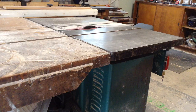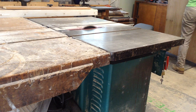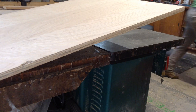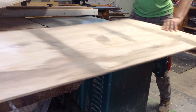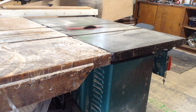For the tops and bottoms, I rip them to one continuous width on the table saw and then section them out on the radial arm saw. I cut the smaller dimension first. The quality of the oak ply I found was awful — marks and stains on it — but luckily this backer goes to the back of the cabinet where you won't see those marks, especially once stained.